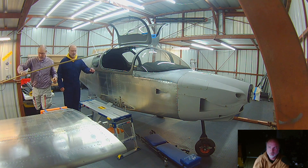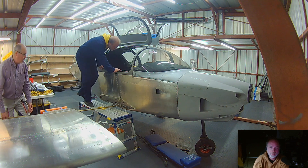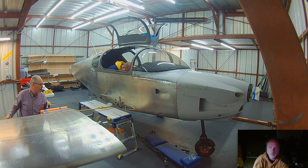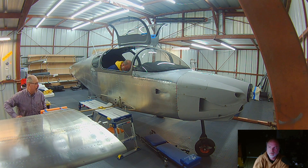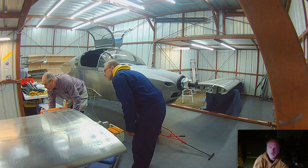I made a mental note of that and made sure I wasn't going to run into any problems. 24 hours before we did this, I got the bolts on dry ice so they'd been shrinking ever so slightly during that period. The other thing we needed to do was get the correct end of the control rod squared away and insert it into the wing before putting the wing on, because this is the last time you'll be able to do it. I already had the eye bolt attached to the carry-through rod on the controls.